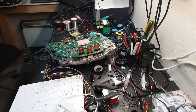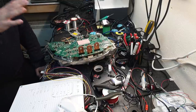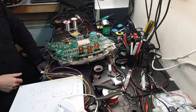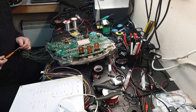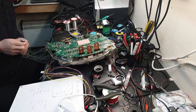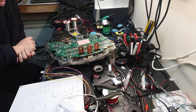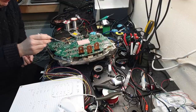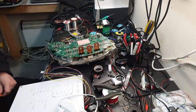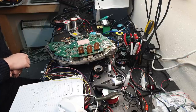We're back again. What we've got here is our Model 3 rear drive unit inverter minus the mod chip which we removed in the last segment. What I've done is connected to the JTAG port of our TMS320F28377 microcontroller. You might ask why I've soldered here rather than using the connector — I did get the connectors, but the pins are just so ridiculously small that I cannot crimp them, so the simpler option was just to solder on.